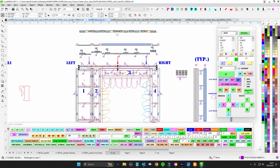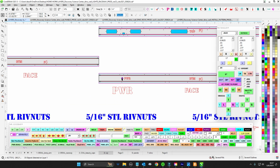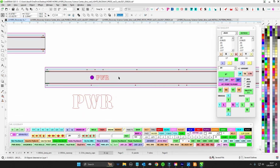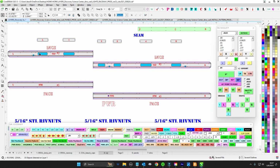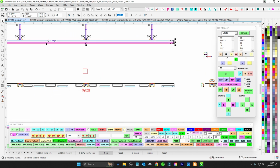And that's where I have that hole. So that's set up for MC cable coming in there. And like I say, you want to go ahead and maybe put a green screw right there with a nice leash for them to ground and bond this thing so they can make their connection. And then I have openings on the top all the way along, so that way install can feed wire through, and then they're able to hit all these points.